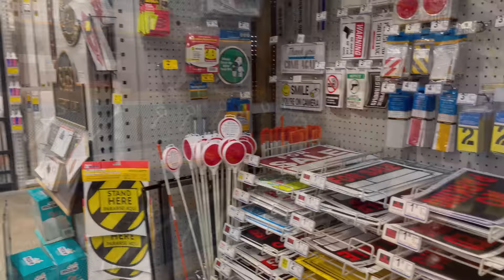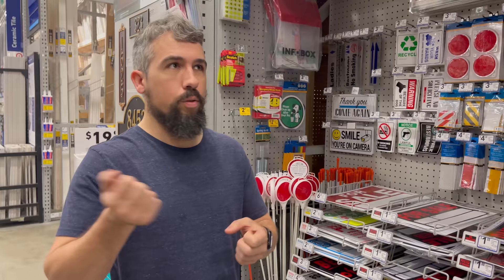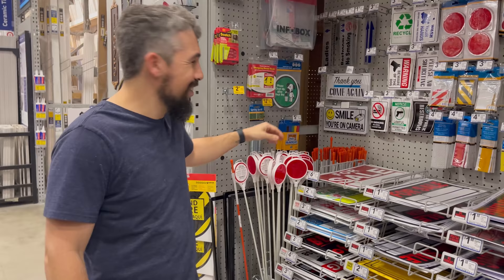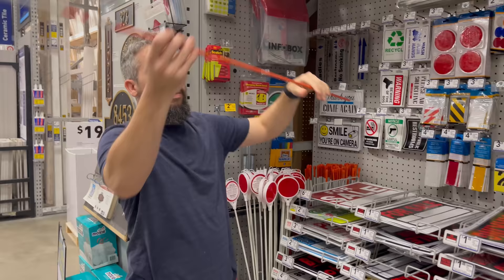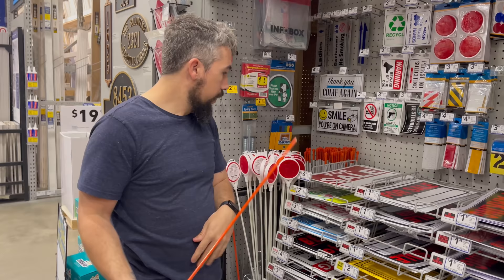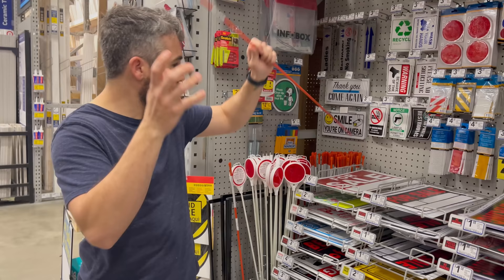You've seen my videos using the Go Bar deck and a lot of people ask where I get the Go Bars. They all come from right here. I buy these driveway reflectors and cut the reflector end off — they're fiberglass rods and they work super well as Go Bars. You can also get the thicker ones without the reflector on the end; they're fiberglass too and work really well. Just get rid of the pointy end, and on Amazon you can get little rubber tips for them. These are two dollars — about a tenth of the price you'd find them for online.